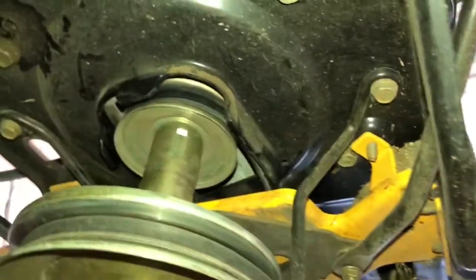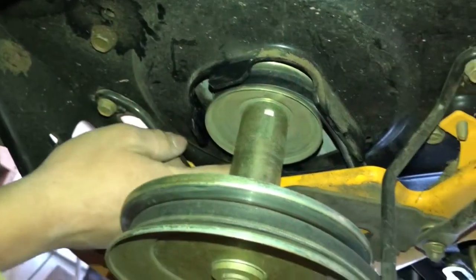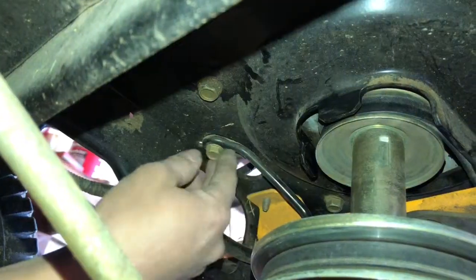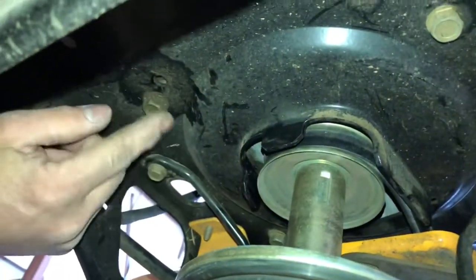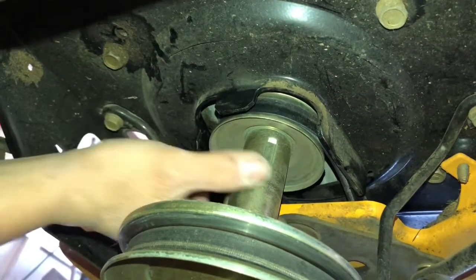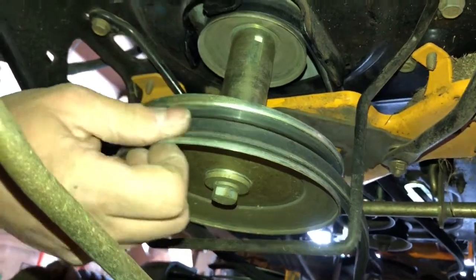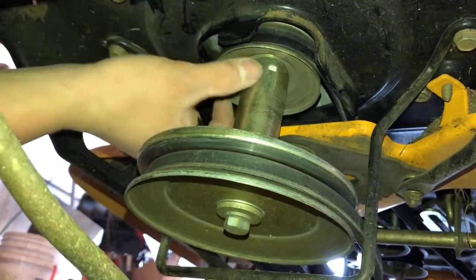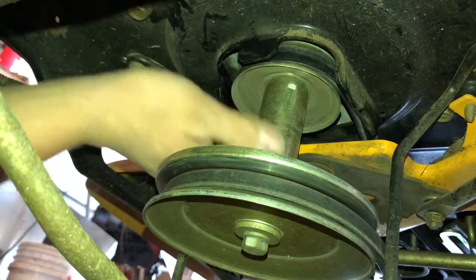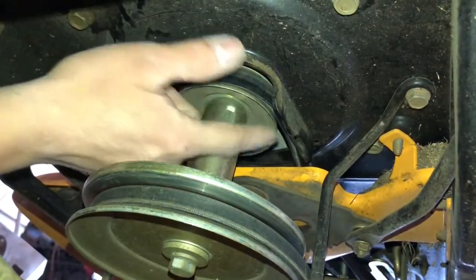What we got to do here is we're going to be changing the transmission belt - this upper belt here. We're going to have to unbolt this guard here, get it out of the way, then unbolt the four bolts that hold the engine down so we can move it. I really don't want to try to get the shaft off the crank, so I'm just going to unbolt the engine to do it.